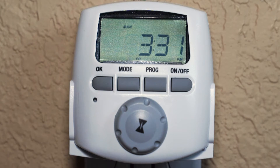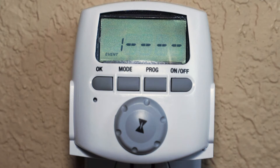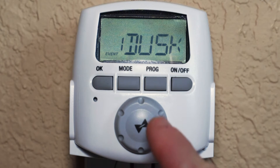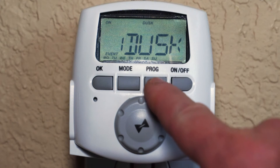You are now taken to the current time and status screen. To create a new program, press the program button. You can set your first event, which in this example is for the lights to turn on at dusk every day of the week. The event number flashes on the screen. Press the program button to confirm that you're creating event number 1. Turn the dial until you see your desired setting displayed. Once you see 'on' at the top of the screen and the timing 'dusk' in the center, press the program button to move to the days selection. The days of the week flash at the bottom of the screen. For this example, we want the lights to turn on at dusk every day, so press program to confirm this setting.